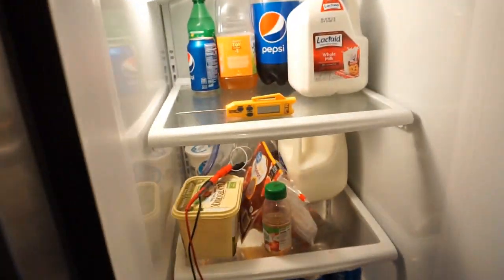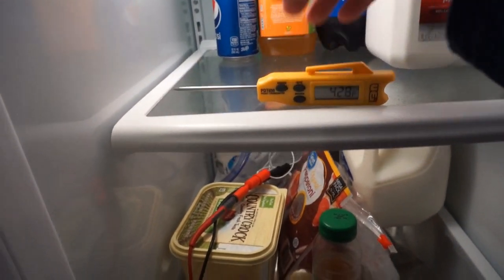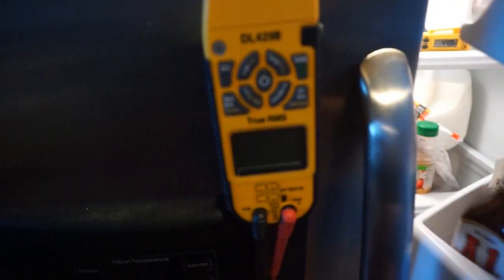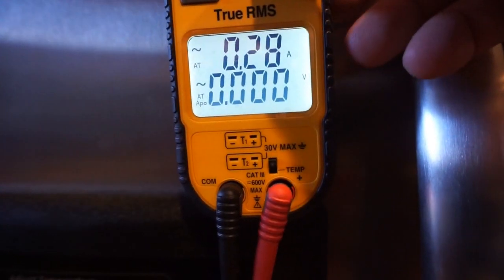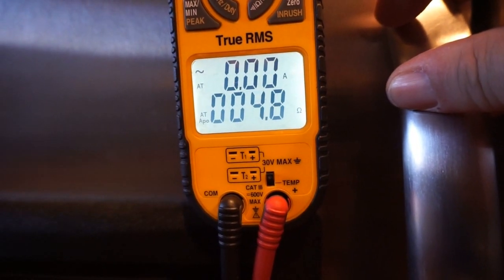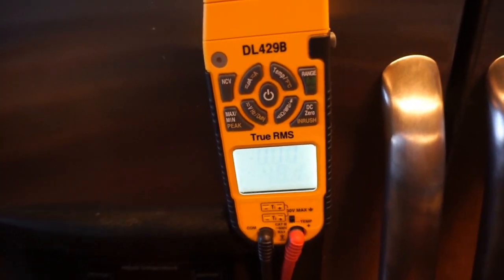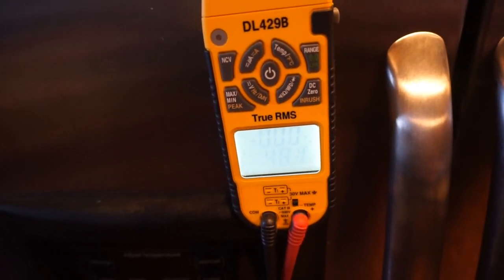Alright let's go check on our little project here. Temperature was 42.6 so far — we're down in there beyond the pepperonis. It was in the low 40s, and as you guys can see we're right in there at about 48 ohms. So it doesn't change an awful lot at all, so that's really good. Troubleshooting the Honeywell Glowfly — if you get out of the 40 to 50 ohm range it looks like maybe it has a problem.